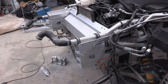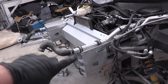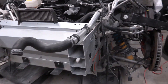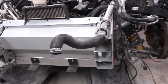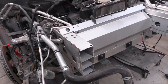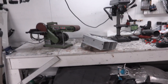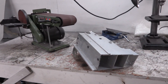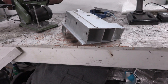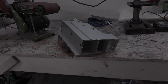All right, we got those brackets off of the frame rail without too much trouble. I went ahead and took the orange epoxy bonding material off as well — ground that down. So there's two on that one, two on the bottom of this one, and just two on the side of this one. That's all done. Now we're ready to build our slip covers. I'm going to use this piece that we cut off as our template, build from one side and then the other so I can have a mirrored one. I'll just grab the metal stock that we have and start building.